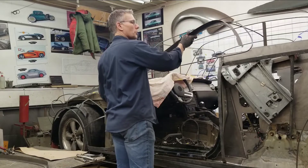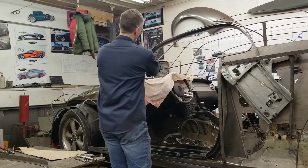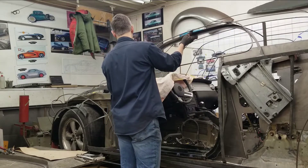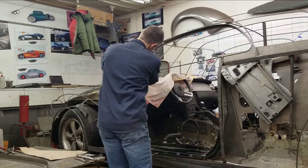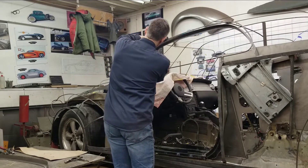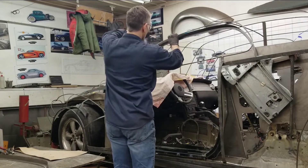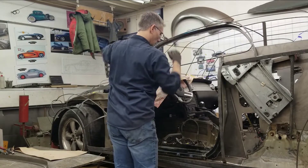After a few minutes in the shrinker, we've got two pieces made up — one for each side — and I'm just fitting it into place for the final time here. I had to take a little piece out of the front corner just to have this piece come out and become flush with the outside of the rod. That's sitting pretty good there. Now I have to fish it down inside the A-post pillar of the front, just like that. It's fitting up really well here, so I'm going to put a few clamps on.